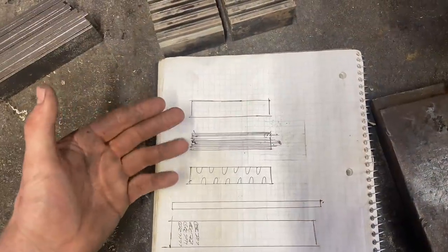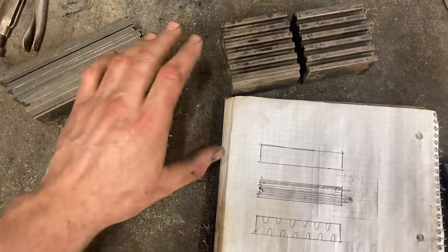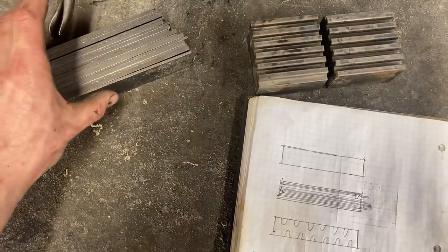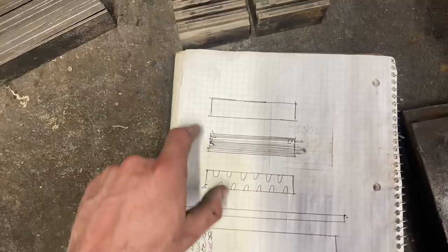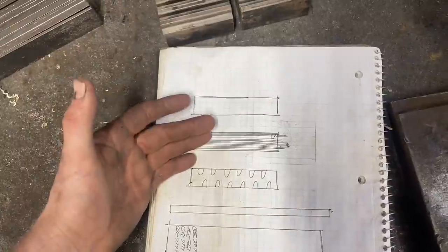So if you've never made ladder Damascus, it's pretty simple. You just go ahead and start with your billet. We're starting with 16 layers. This is a pattern that tends to look better at a higher layer count. So we're going to cut and fold this or restack it four times. That'll give us 256 layers, if I'm not mistaken. And basically, you just forge weld it together, draw it out, restack it, do that again and again until you get to the layer count you want.